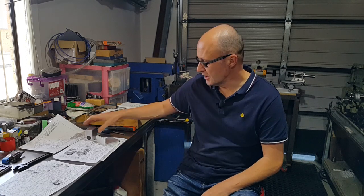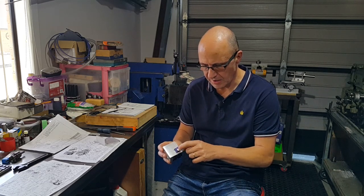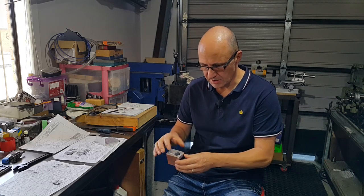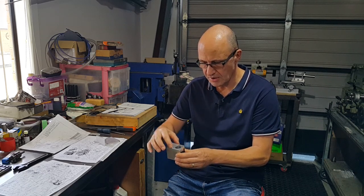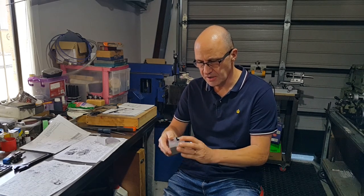Hi, my name's Kevin and welcome to another video. In this video we're going to carry on machining the cylinder head. I've done some bits — just drilled some fixing holes, and there's my slot in the side here for where the push rod is going to fit into. What we're going to do today is machine around the cylinder where the cylinder head is going to go, machine a radius around there, and then carry that radius across and machine this area flat. Then we've got to flick it over and do the same again on the other side. I'll bring you in and show you the drawings and then we'll get set up on the miller machine.